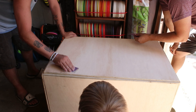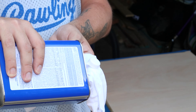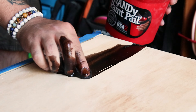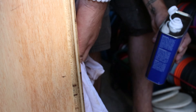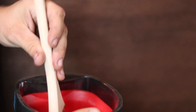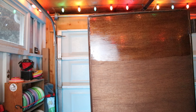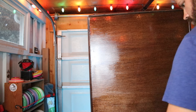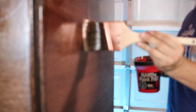Once we finished sanding, we put some acetone on rags and started wiping down every surface and then adding stain. You will note that Colin doesn't wear gloves — wear gloves, people. I can't recommend enough that you wear gloves because his hands were stained for a good week. Here you'll see I'm applying the polyurethane. Once the stain had dried, I started adding coats of polyurethane, not only to protect it against water but to give it a nice shiny finish. I think I used a semi-gloss finish to be specific. Because this is a reef tank stand, I wanted to make sure the waterproof aspect of it would be very effective.